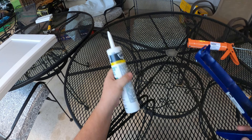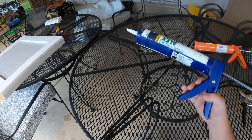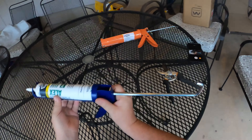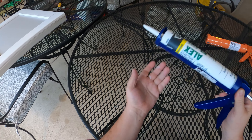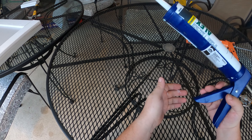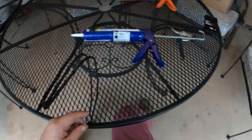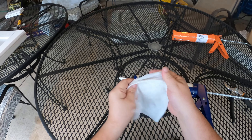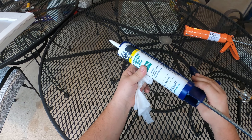Now load up your caulk — this applies to pretty much any type of caulk gun including the power one. You want the tip to be facing up on the long end. Some people take a permanent marker and put a line as a reference so they know where it is. Pull and notice first it moves the caulk into place; once you hit resistance, any more pull and you'll start getting caulk out. Before you start caulking, always get yourself some type of paper towel — you want something to clean yourself off, like a slightly damp paper towel. As you go, you'll inevitably get caulk on yourself, and it generally cleans up easily with water unless you're using specialty caulk.